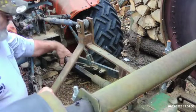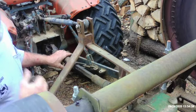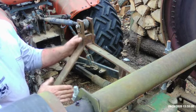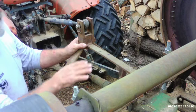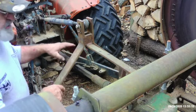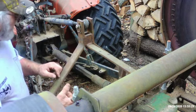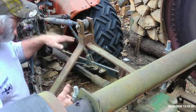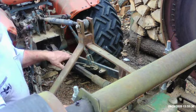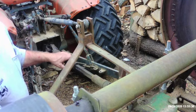Now, like the saw blades themselves, you hear all kinds of horror stories about the actual power takeoff unit. I told you I took this old stationary rig, that's in other videos too, and I converted it to operate off of a power takeoff by building a three-point A-frame for the back of any Category 1 tractor, and put that right-angle drive off a John Deere haybine and converted it with a short-coupled power takeoff shaft. So I pretty much eliminated any potential of entanglement whatsoever. You'd have to really be a fool to get anything you own entangled in this power takeoff shaft in operation. So this particular one requires no added safety or concern, because it's virtually impossible for everybody but an imbecile to get tied up in it.